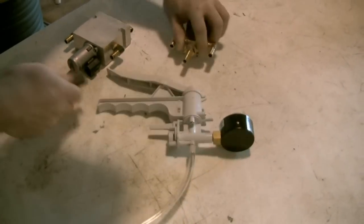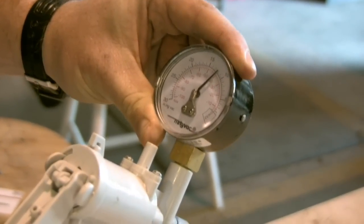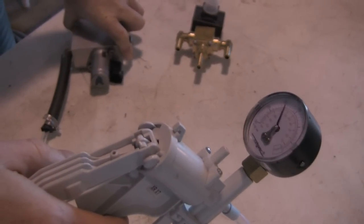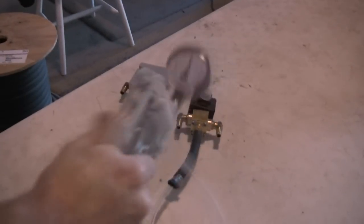I want to quickly contrast that. This here is our normally closed port — we'll take it up to 25 inches of vacuum and she's holding steady. Now over on the HydroForce, we can't even get it up to 20 because it's leaking so fast and it just drops down. And lest anybody think it's just because the hose isn't tight, we'll see if we can get these sealed — now it's holding when I've got my fingers over there. No fingers on it — it's dropping. We take it off of here, put it on there, no fingers on it: over 20, and we can take it up to 25 — rock solid.